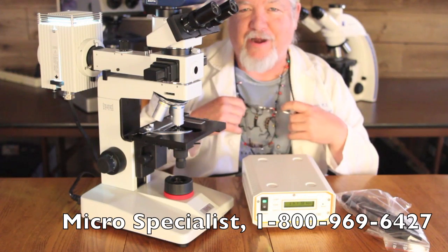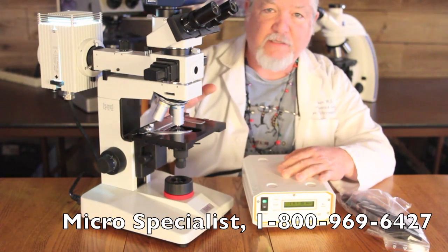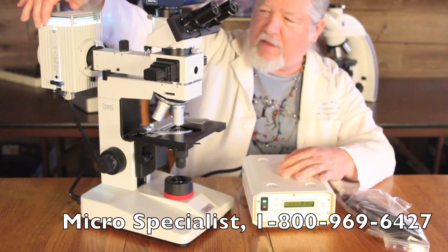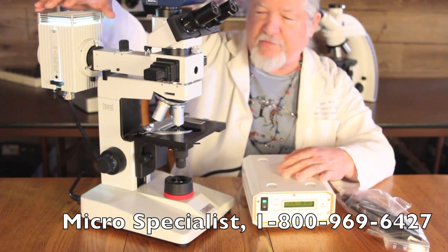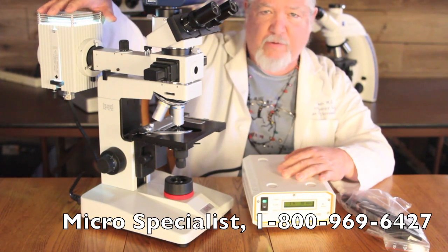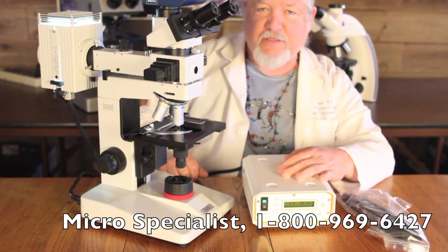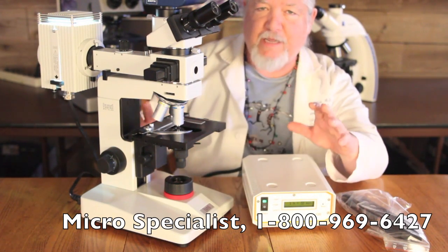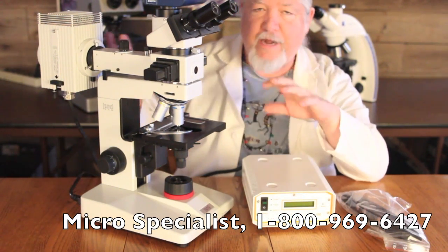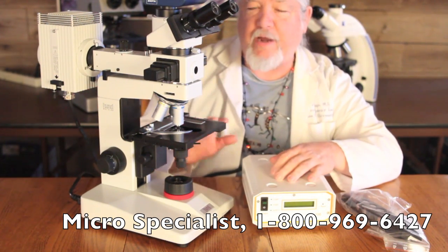I guess I reserve the right to wear some Christmas bling even into 2016. As you can see, this is a special microscope with a special illuminator up on top and a lamp house. You can see all the light coming out of this lamp house — it's a very bright and very hot light source. This is a mercury burner, and it burns hot, so the lamp house is hot to the touch. The first thing we have to do before we deconstruct this microscope is turn off the power supply. We're going to let it cool down, then we'll proceed through a demonstration of how this microscope works.